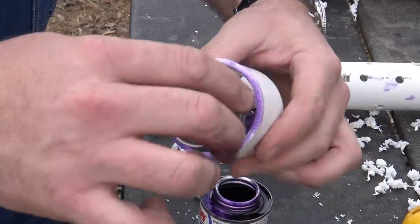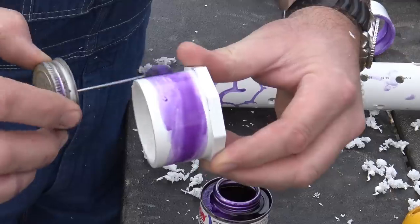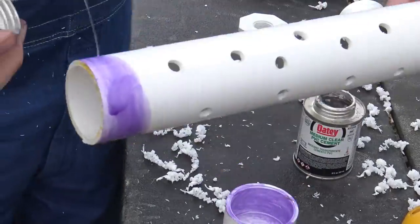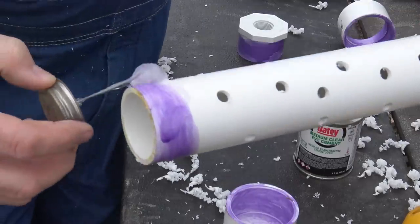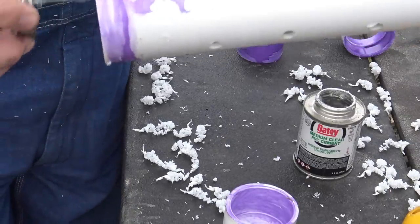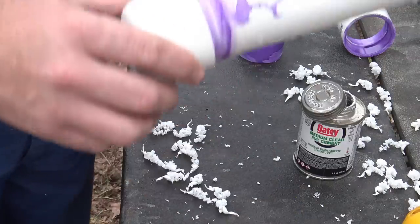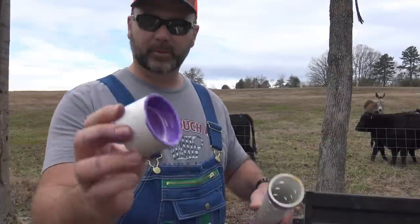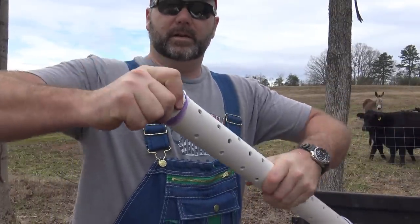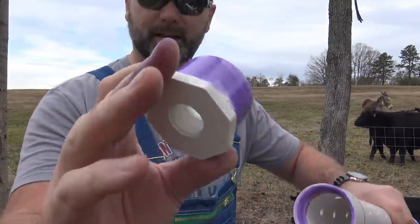Be sure if you're priming PVC that you go over the lip too. This is the connector — three-quarter inch — and here's our end cap. This is a low-pressure system, meaning there is no pressure on this, so we really don't have to go this far, but we are. Put our end cap on, then put our coupling on. This is two-inch schedule 40 PVC, and this is the end connector right here.